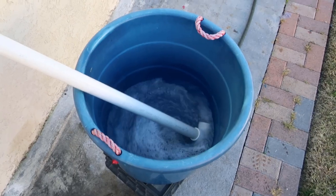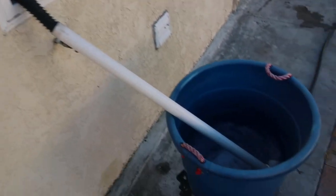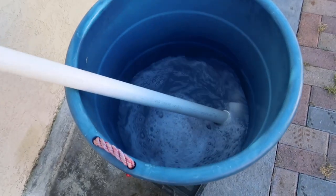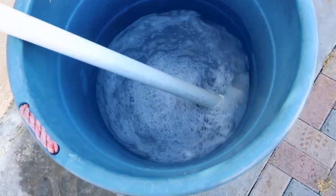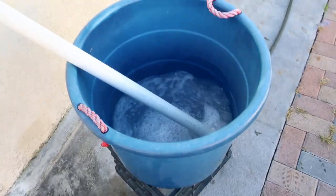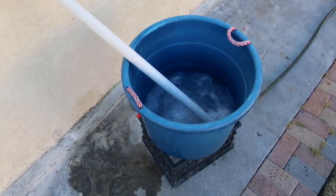The one and a quarter PVC elbow needs to be attached to the pipe end inside the container. This is in order to create a sump effect on the water flow. If no elbow is added, the pressure from the water pulls back up to the laundry discharge line and PVC pipe connection point.